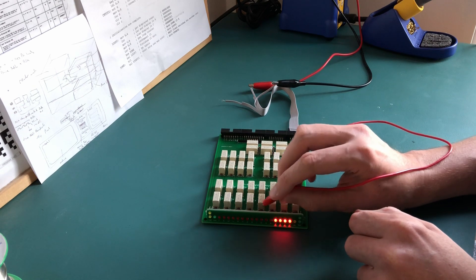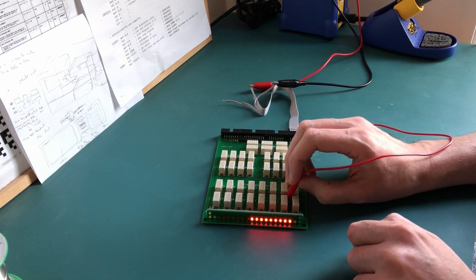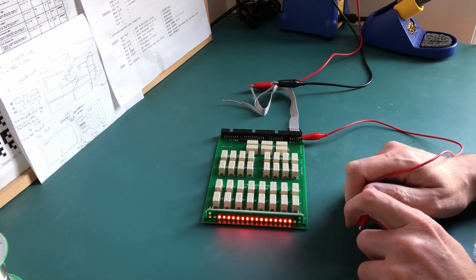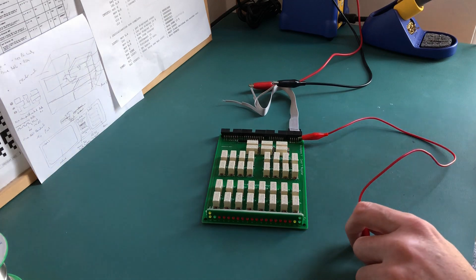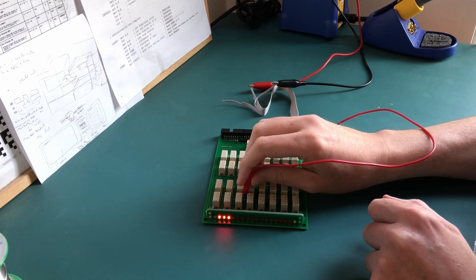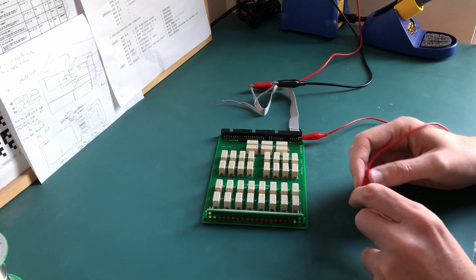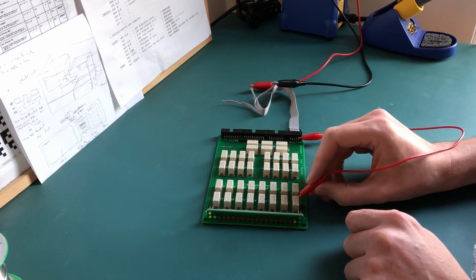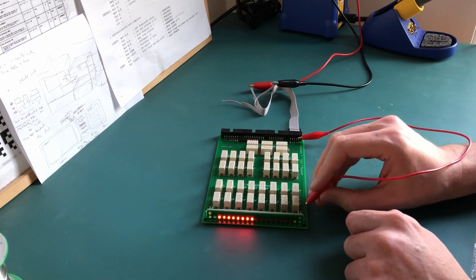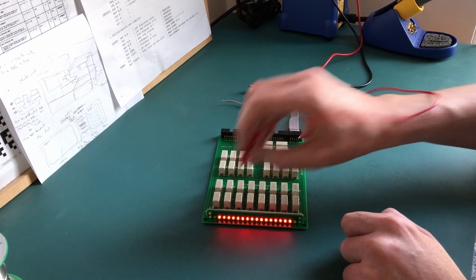If I bring them on like this, what I'm doing is just bringing them on in order to make sure that they're working and the light's coming on down the bottom, which just tells me the circuit's okay. Good, that's all there. If I cut power now they'll just go off. If I bring power back on again, I get the click as the hold circuit comes in, and I should be able to do this in reverse order — just making sure each one is coming on in the right order. So I'm happy that's all working as it should.